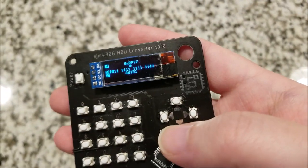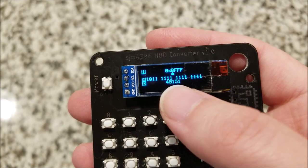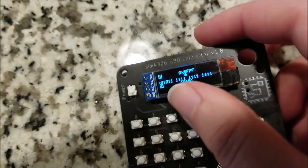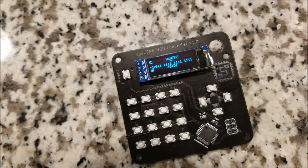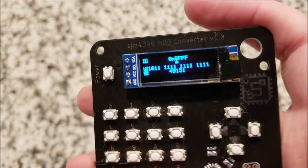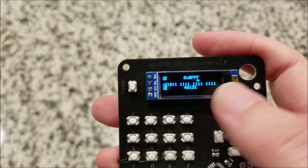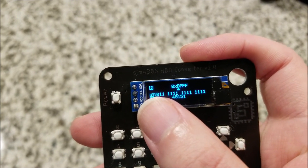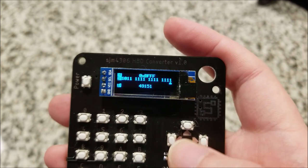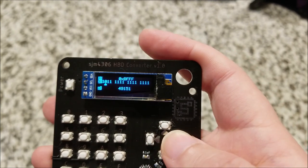But other than that, we have a beautiful OLED screen here, and I've been meaning to use one of these displays on something. I had this in my parts drawer for the longest time. And actually, let's peel off the protective tape. The protective tape peeling has been done. And there we go. Beautiful. This is a 128 by 32 screen, and it was just enough to fit the B and then 16 binary digits with a space in between so that you can easily tell which nibble is which.